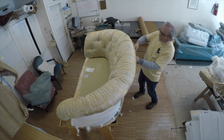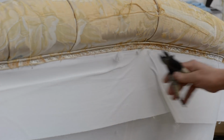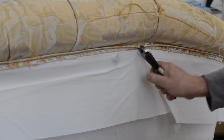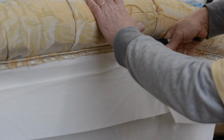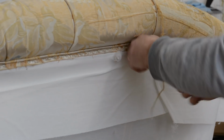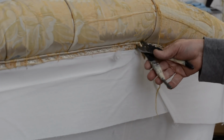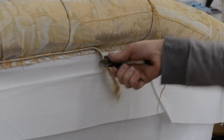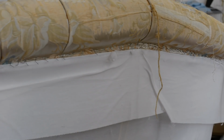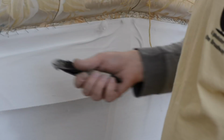And then now we're left with the remaining staples from the ply grip, which I would do first. I would tackle that first all the way around, and then I would tackle the piping that's here. Usually the piping will come off. I just cut the piping there. It should come off easy, which it does, as long as you pull it the right proper way. Careful when you're doing that. Sometimes I've punched myself in the stomach or the nose when I'm pulling like this, so I get used to getting your body out of your way when you're putting the torque on the side cutters.